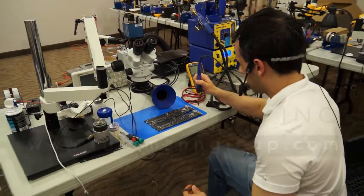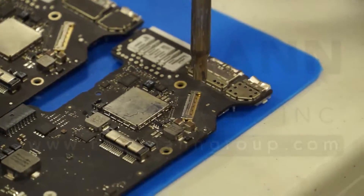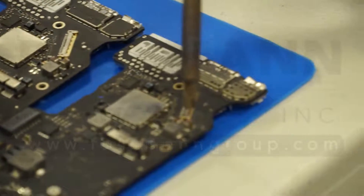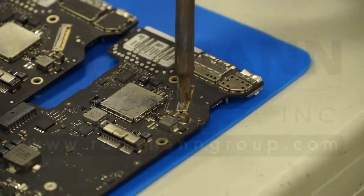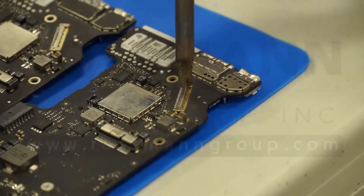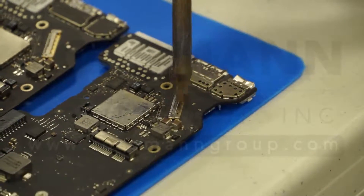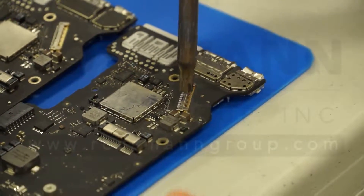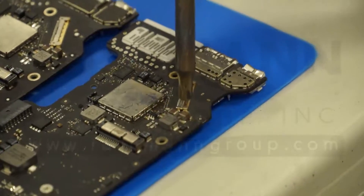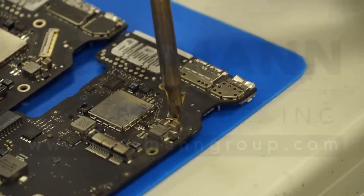I just hit this — let's see how long it takes to remove the LCD connector. One thing to note is that you barely feel a stream of air, even though the air on this has been turned up to 100%. I'm just moving it back and forth. My assistant Sonny is holding the camera because I didn't bring my setup to record from the microscope camera. We're moving back and forth here. Let's see if I'm even remotely close to removing this. No. Not even close. I'm going to keep going with this until it eventually gets hot enough that I can remove it.